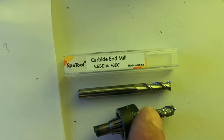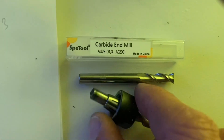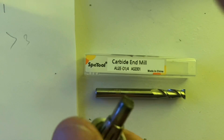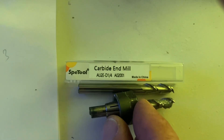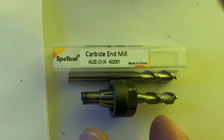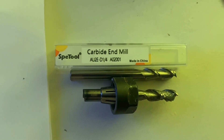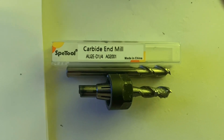Here's the same cutter, except I'm trying to keep it as close as I can to the motor or spindle. So I cut the one I'm using right now — I cut it shorter. Not a lot, but enough that it's just a little bit shorter inside, so it doesn't stick down as far. It doesn't get the leverage on the motor that a longer bit hanging below the motor would give it.